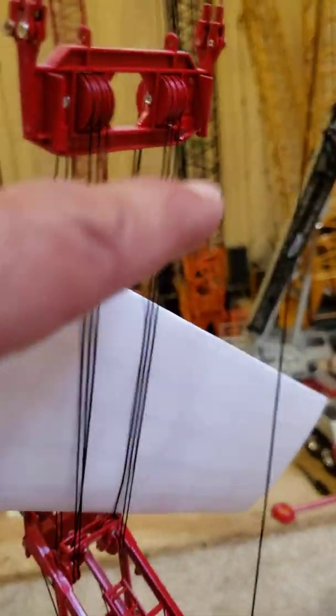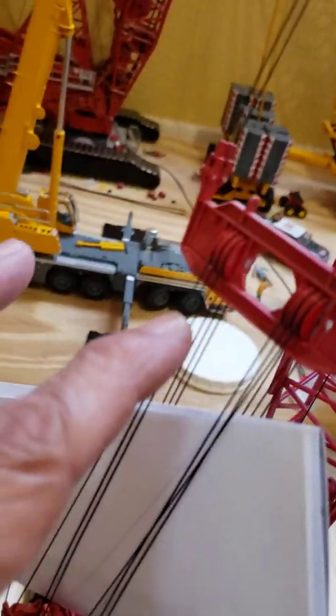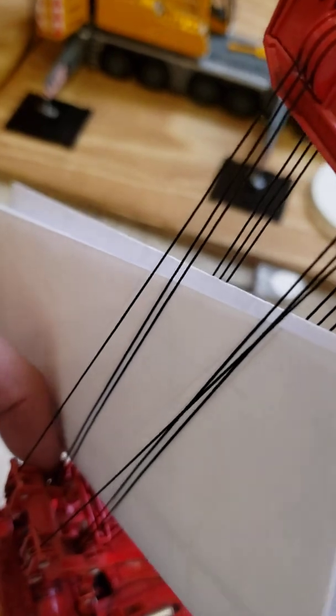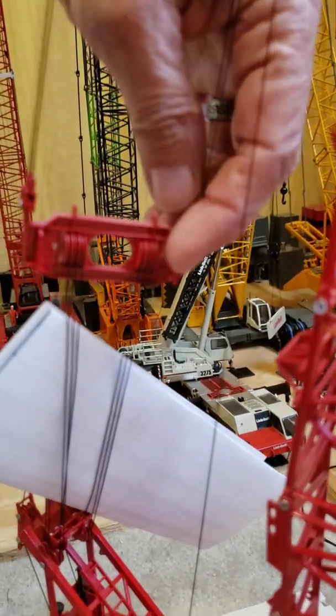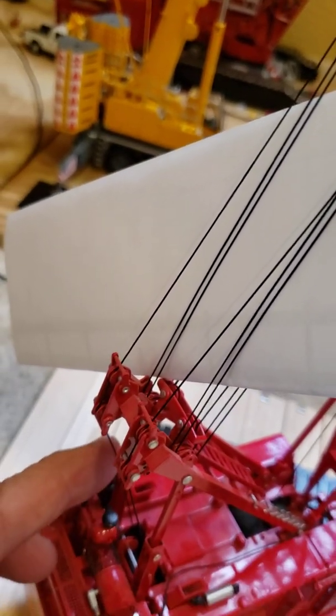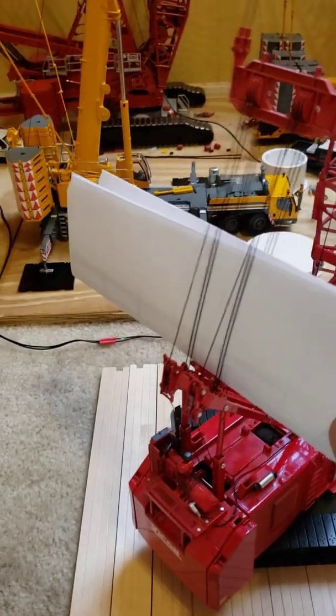It's going to come around from here up to here. We're on this middle pulley now. Back around this side — it's going to come from this middle pulley down to this second pulley down here. It'll come around that and then up around here to this last one. And then from here you can see it's going to come right down there and then down to the drum. And there's your full reeving of the bridle on these 4100s.